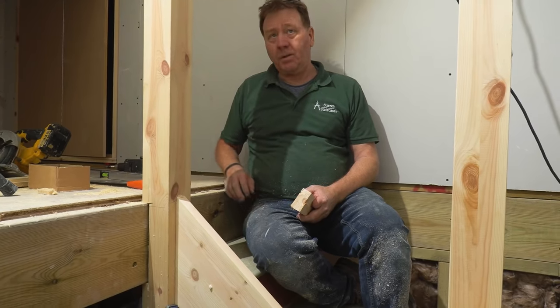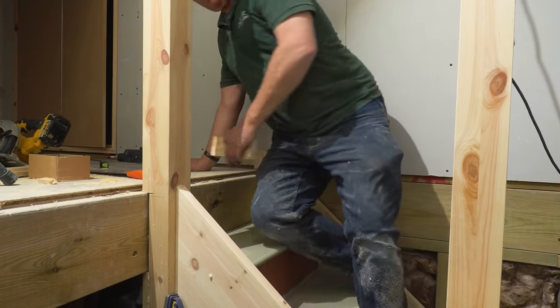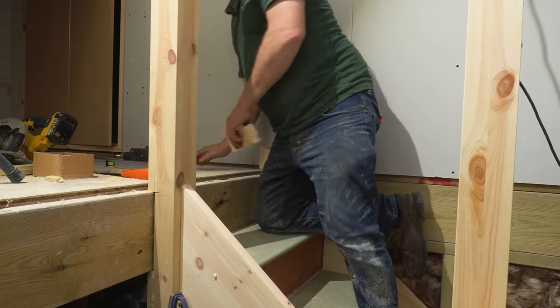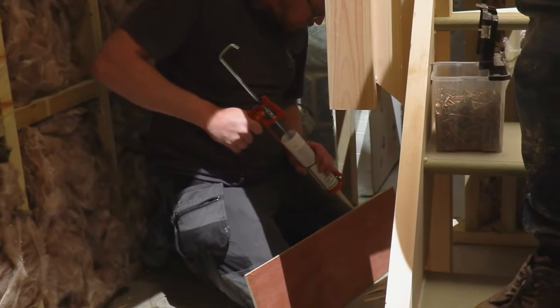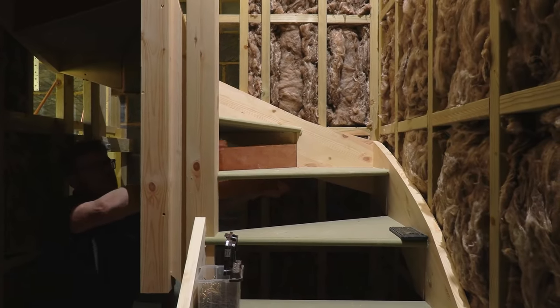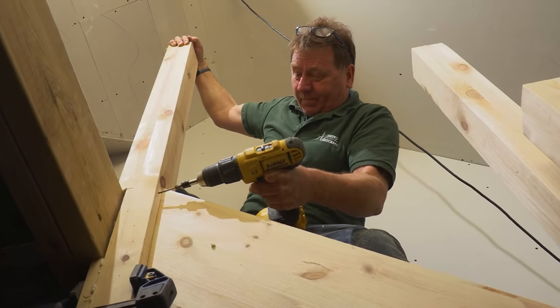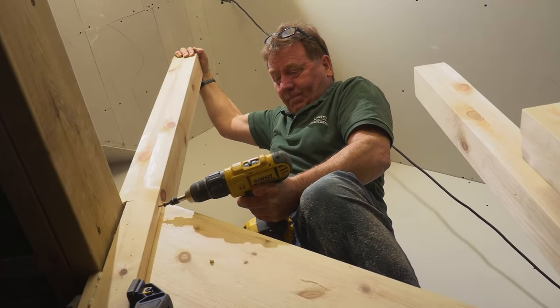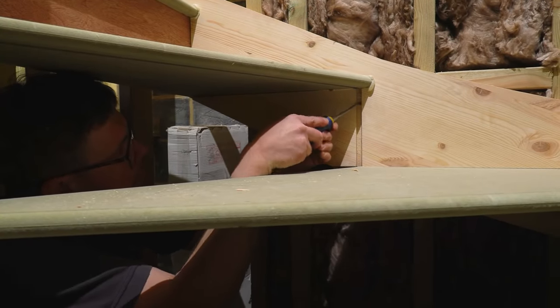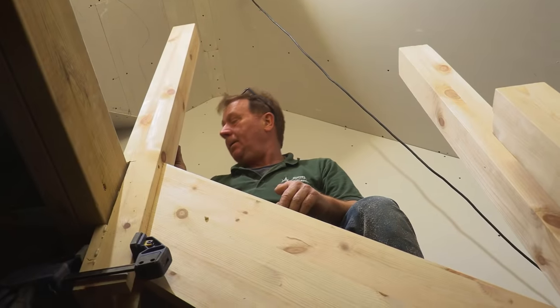And, got a riser underneath it. Yeah. The final sin, if you like, is that he put it in from the bottom up. Which a lot of people go, you always start from the top. And I must admit, there are advantages to starting from the top in as much as you don't have to butcher that newel post when you get to the top. It's just in there, isn't it?